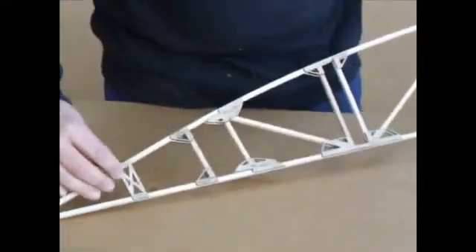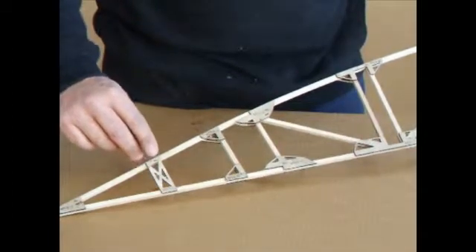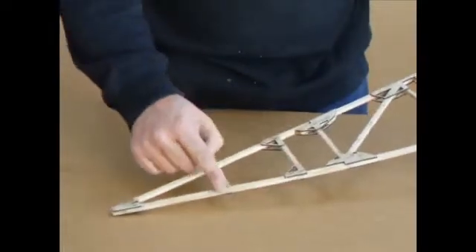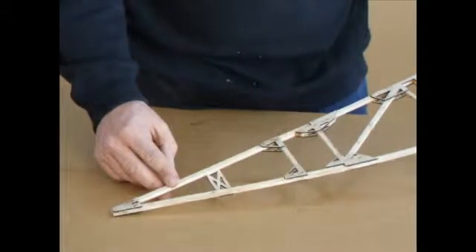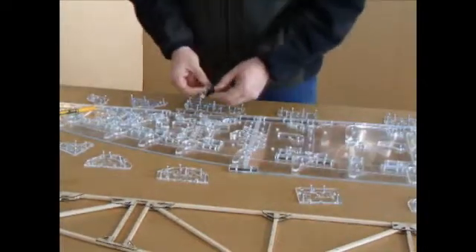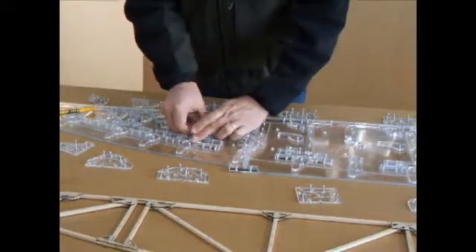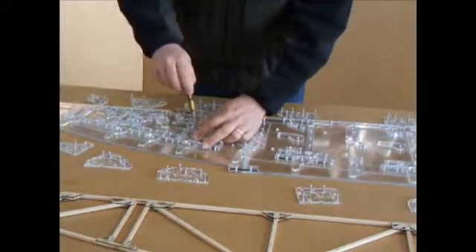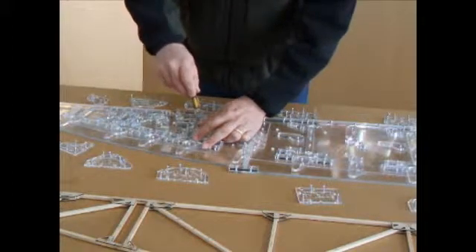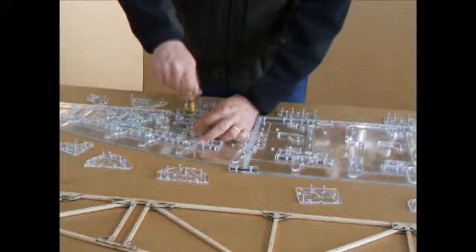In this case, this is a right-hand side wing rib, and wing rib gusset number seven is placed on the right-hand side only and not on the left-hand side. Once you have removed the wing rib from the jig, you can replace the parts that you had to remove in order to release it — in this case, 37A and 37B.